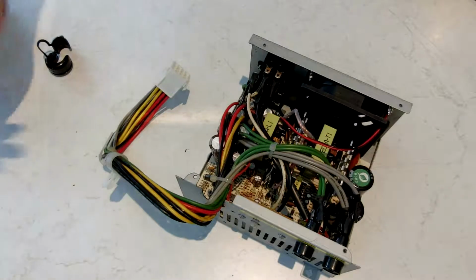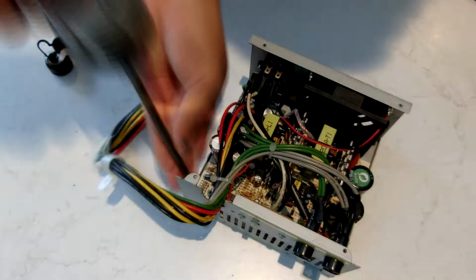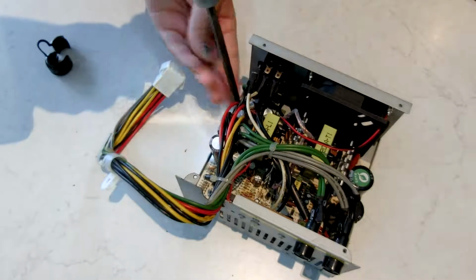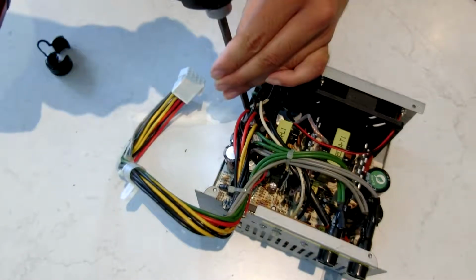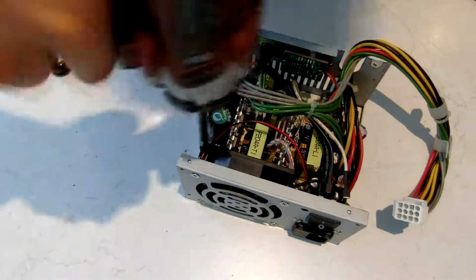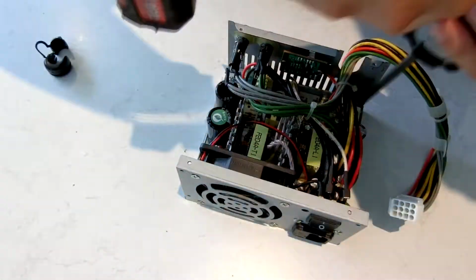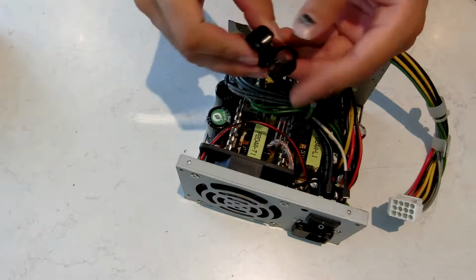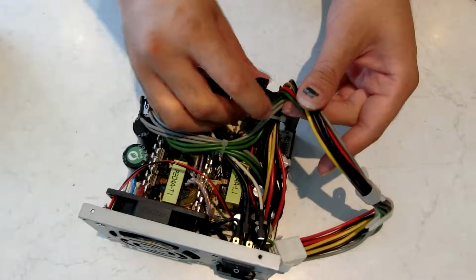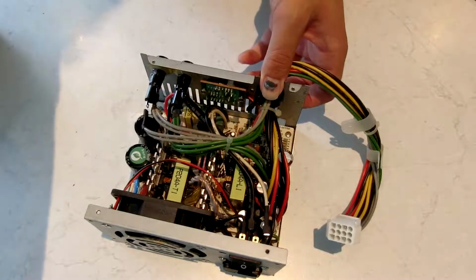So now the last couple of steps is you need to put these screws in. These are the ones for the board. I always put them in a couple of turns until all 4 of them are in, and then screw them down, because otherwise the board can be misaligned. Don't forget to put this grommet in, the side with the loop goes on the inside. It goes in that slot there, and your wires through, and it goes over.